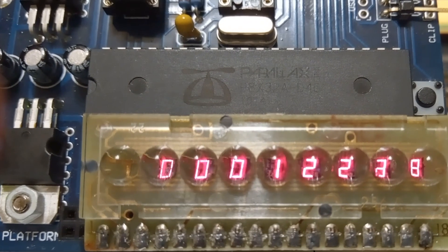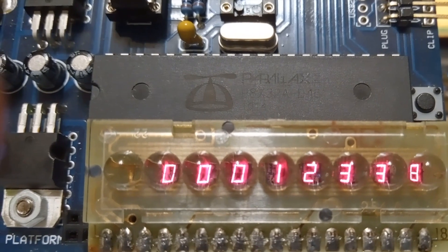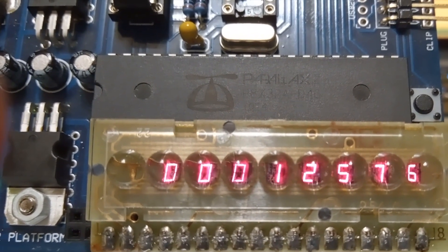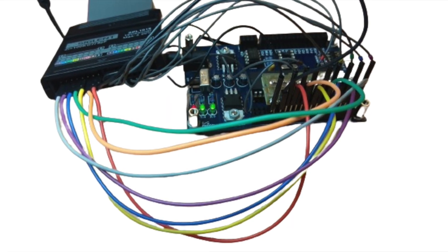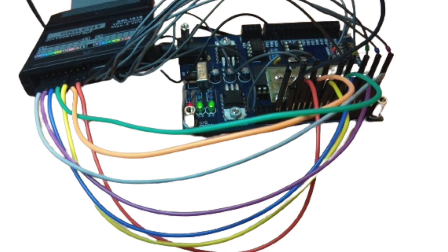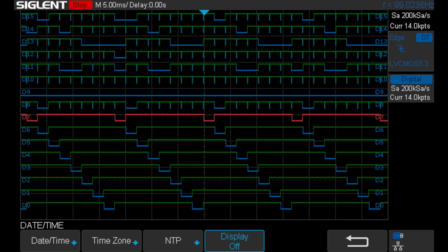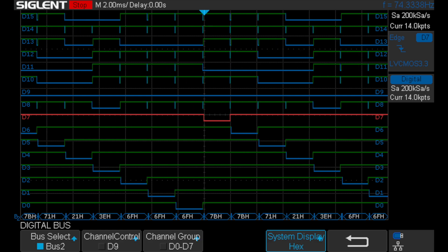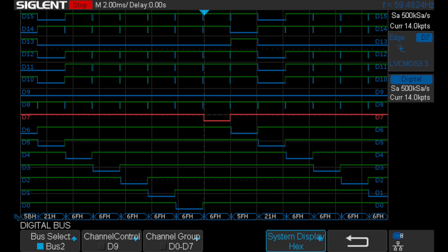Another circuit visible now is a propeller processor-based 8-digit 7-segment LED display decimal counter. Here I put the logic analyzer inputs on the anodes and cathodes of the display, intentionally not in order. From the resulting waveforms, even weaker students can find which channel shows the decimal point, and the better ones, if they know the counter only counts for a short time, can also find the G-segment.